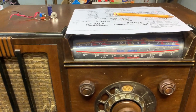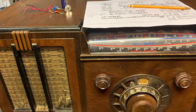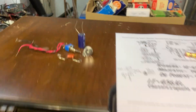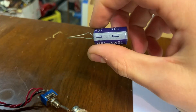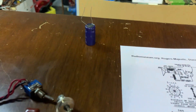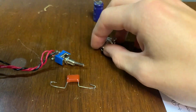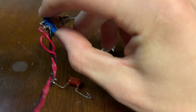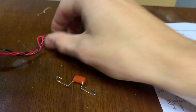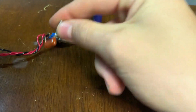I'm going to add a quick audio input to this so that I can use it for something else besides crappy AM radio. I'm also going to add in the missing filter capacitor. And for the audio input, all you need is an RCA jack, a small two-way switch, and a 0.01 microfarad filter capacitor.